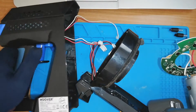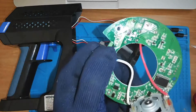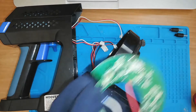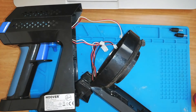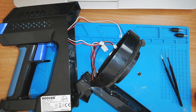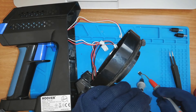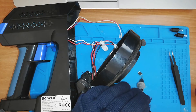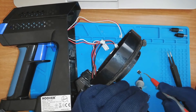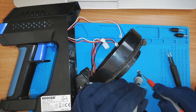So the MOSFET over here — I took it out, this little MOSFET right here. I put my meter on diode mode to test it, and you can see there's a bridge straight through — it's shorted out.